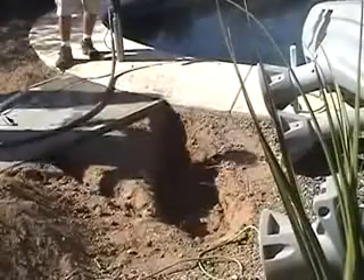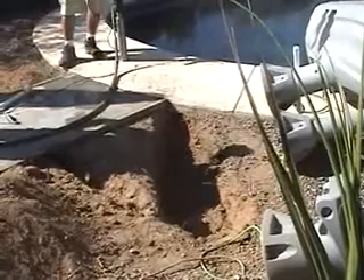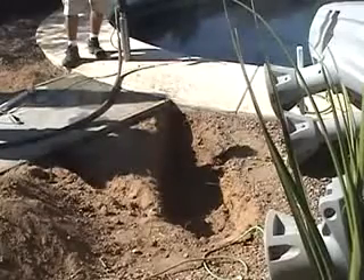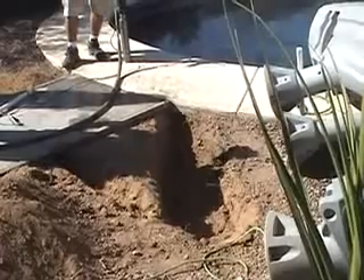What we have here is a shallow trench that we dug, and it points directly toward where we will core the deck. This trench allows us to keep our water wand level with the bottom of the deck and to catch or direct the overflow water.